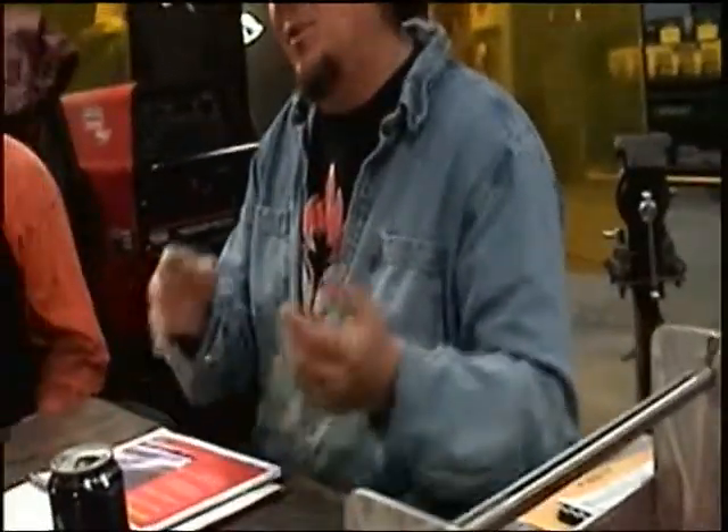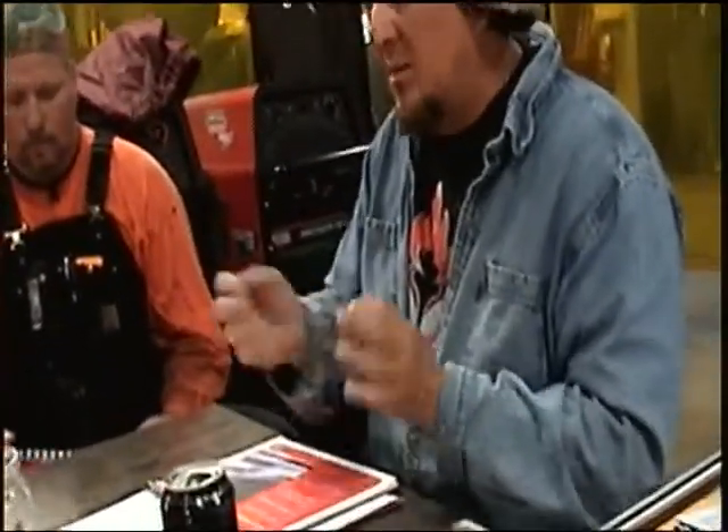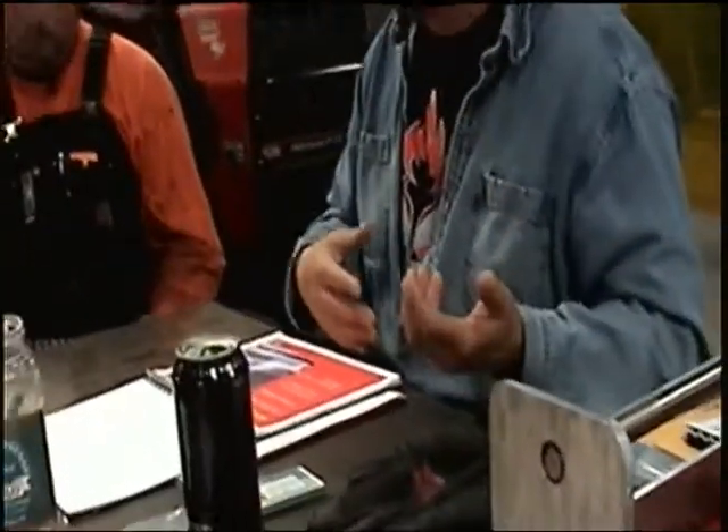The only thing that's tough about steel is the prep work. If you buy hot rolled steel, which is the normal steel, it's not orange — it's black. It's got a mill scale on it that you've got to clean off, so you end up having to grind it until it's shiny. If you buy the cold rolled steel, which costs about one and a half times more, you don't have to. You can just brush it a little bit and weld, but you pay more for the steel.